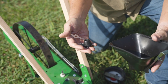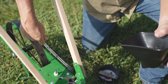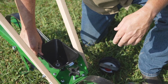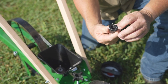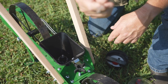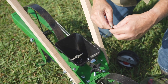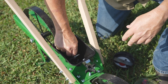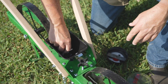Here are the components and how you put the new drill hopper on — pretty simple. It will actually come with the gate already installed. Once we take the other hopper off, we simply put it on there. It's got these little things to catch into the line on the seeder. Then here's the agitator — this little piece — we put that in there. It's got a D-shape at the bottom that catches on our gear. Then we put what we call our long washer on top. Without that long washer, the nut would self-tighten and eventually tighten down so much it wouldn't move. Then tighten down the wing nut — it's just a quarter-inch wing nut — snug.